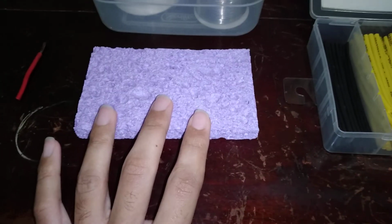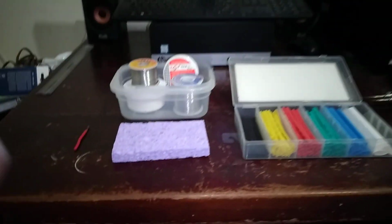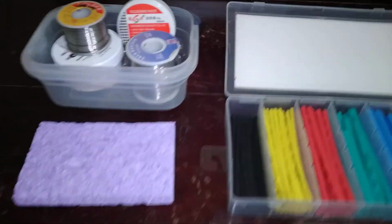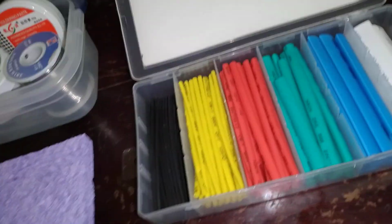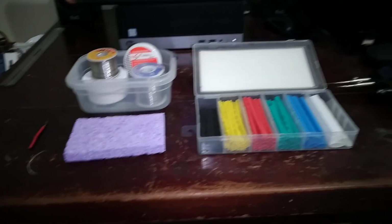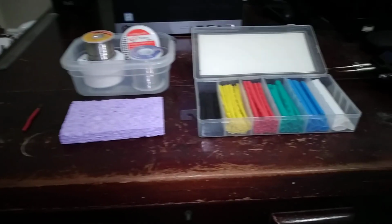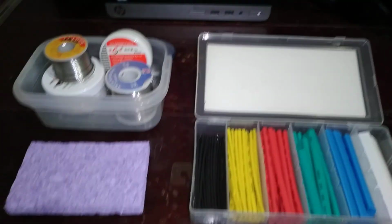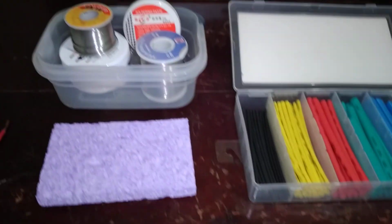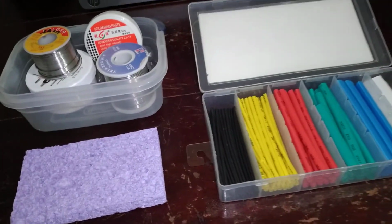And of course the sponge itself. A wet sponge is definitely something to keep handy for your soldering guns, so that you can wipe them off to clean oxidation off the tips. That's pretty much it. Of course, a bottle of some form of cleaning solution. I don't have it nearby, unfortunately, but things like isopropyl alcohol and contact cleaner can be used to clean off flux in some cases, so that's useful as well. Anyway, that's pretty much it. If you're using all of these tools in the way that I mentioned, soldering is actually very easy. Thanks for watching.